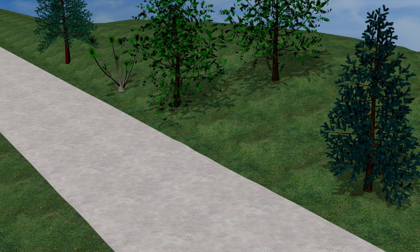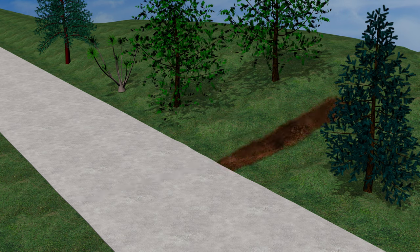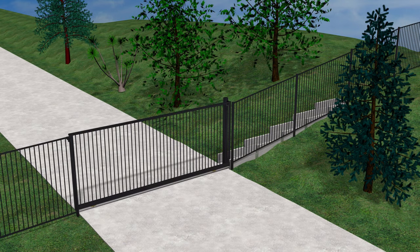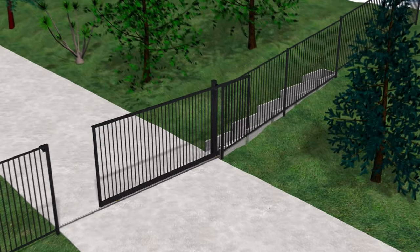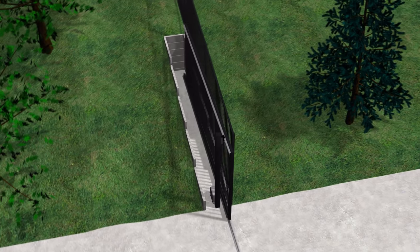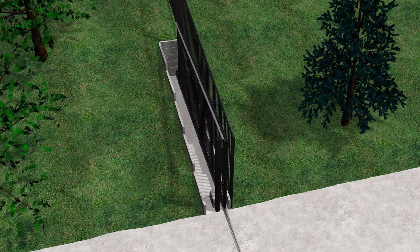If the slope of the ground gets steeper off the edge of the driveway, it must first be excavated, then have a concrete footing and retaining wall installed along with any posts required. A sliding gate can then open into this cavity. The retaining wall must be high enough above ground to keep the footing clear of any dirt and debris. The cavity needs an internal width of at least 500 millimeters to allow access to the back of the motor so it can be manually released, and access to the track so it can be kept clean.